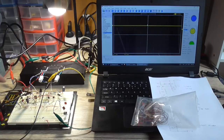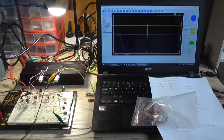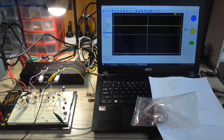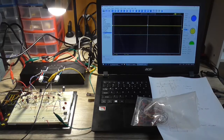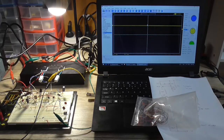Okay, so I've broken the 4K7 from the emitters of the input stage to the positive rail and the join between the two. I've got two 100 ohm dropper resistors here off of our current source transistor, so it splits it into two, driving each emitter separately. Now turn the power on, it's back up to 25 volts. Whoa, and something just went with smoke. That was awesome. I'm not sure what smoked.